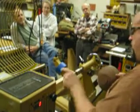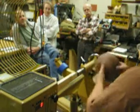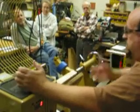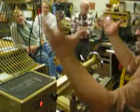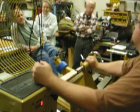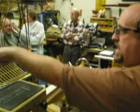So again, because the grain is running this way, it's a heck of a lot easier to shave that wood off of there. Whereas you're cutting in grain half the time on this guy. So it's a little bit harder, and you run at a lower speed. Basically, it's just a safety kind of thing, just as you're fighting these little edges on a big rough bowl blank, you're fighting all the edges and things. You want to run at a little bit lower speed. On some of the turnings that I do, I'm actually turning space because it's not symmetrical. Grab that bowl, that very top thing back there.